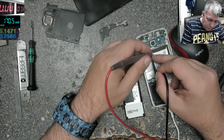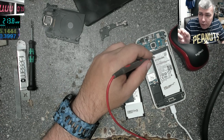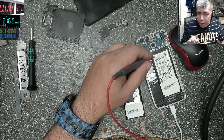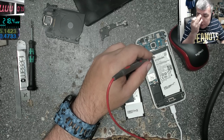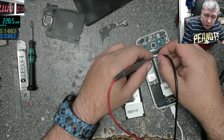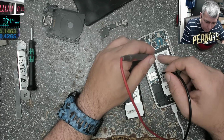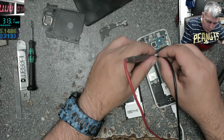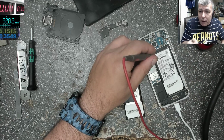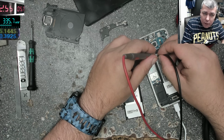So actually, when you check the screen and you see 7.45 volts, just ignore the amps. The amps are a fixed value, it's 2.5, that's my setup. But check the voltage. You see that voltage drop, that's no protection. The voltage drops based on the fact that we have a current limit there, and the power supply cannot supply more current, so the power supply will drop the voltage. That's the explanation.